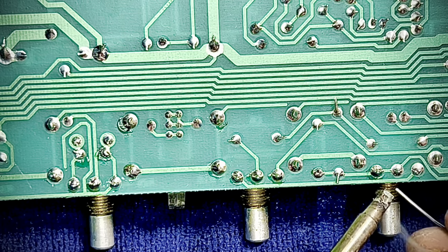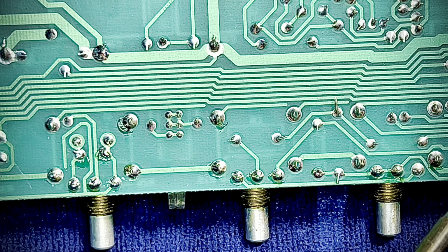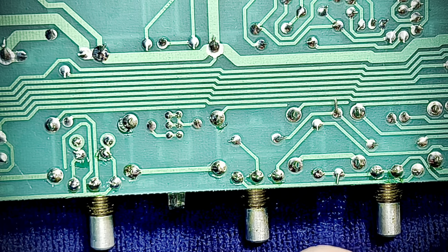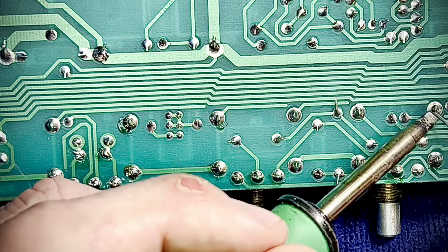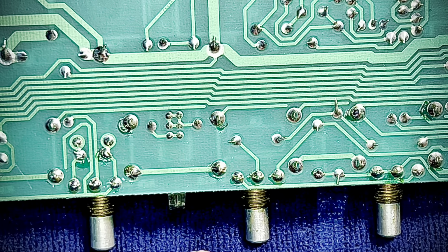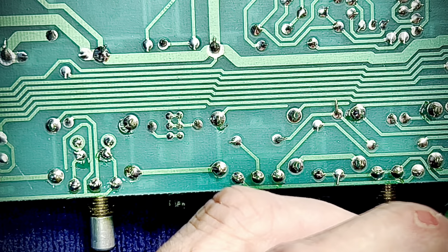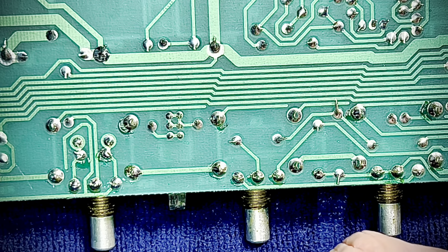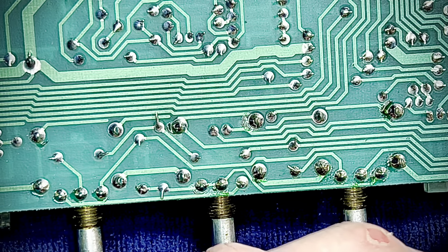See? Hot and fast. You're not disturbing anything. Your solder pads are still there. And you know what? I've been soldering since 1998. Do the math on that. Dude, this one's broken. That's one of the ones where it's literally just the snap-in feet of the pot that's serving as a ground. So those are still critical. It doesn't need to be passing signal to be critical. It's all critical. It's all a circuit. Nice. All right, and I'm almost over to the input jacks. I like it.